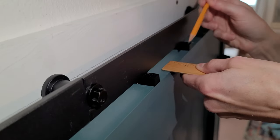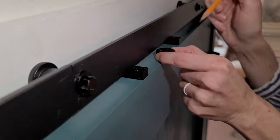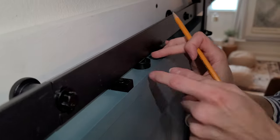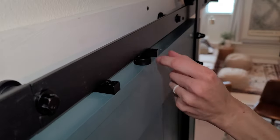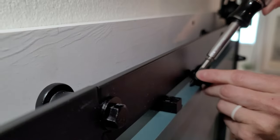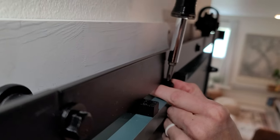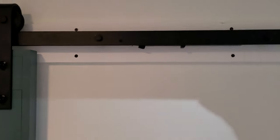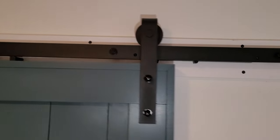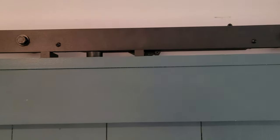For our door, it's important to note how close our actuators are to each other, which means we only ended up using one of the bumpers. The instructions say to install it three quarters inch from the edge of the door. What it does is make sure that if the door is ever pushed out, it won't come off the rails. However, if we put the bumper on the left or right side of the actuator, the bumper would trip the soft close — so one was enough. We also have a wall guide that keeps the door in line, and our kids know not to shove on the door.